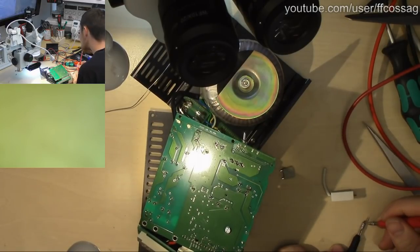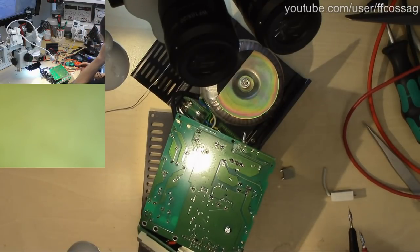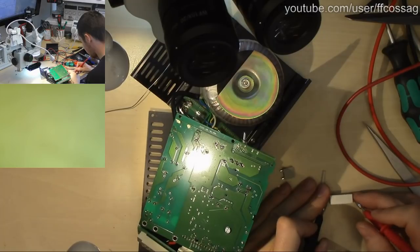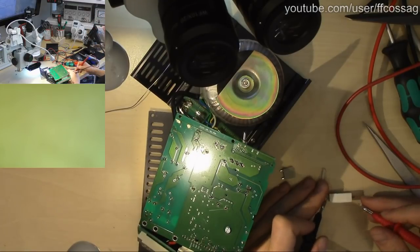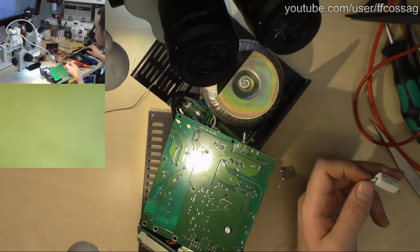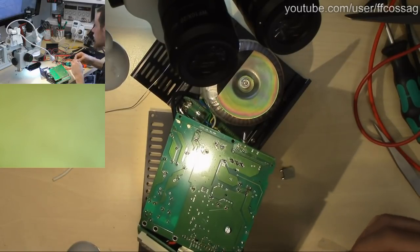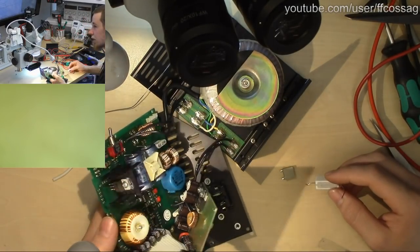because we will have a pretty steady, like 4 milliohms lead resistance here. This measures 120, so we're gonna see an actual real resistance of 114, 115, something like that. So I think we'll actually replace this with this 0.1 ohm. We are going to be closer to spec anyway. And it's going to fit absolutely fine in there.